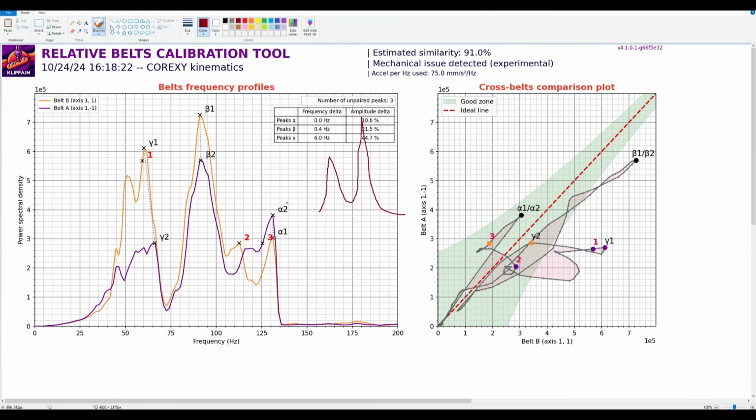It's acceptable. So this could calm it down, and if we use this as both belts, it could eventually be doing something like this. I mean, it's a little high, but it could eventually calm down to that. This is a little high for that frequency. I would expect, if I get the double hump, to be in this range here, but it could, right? If a belt gets tightened a bit, it could happen.